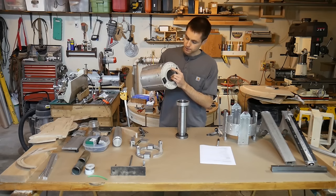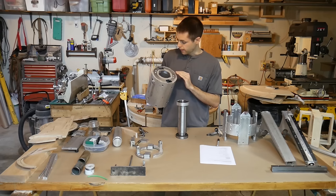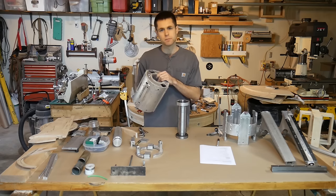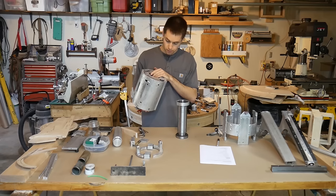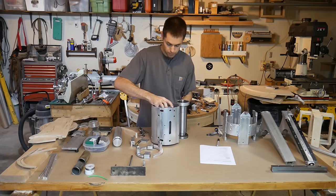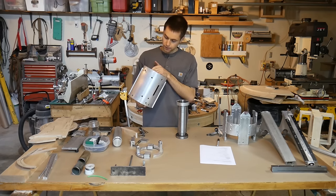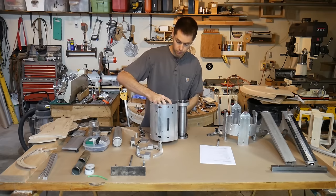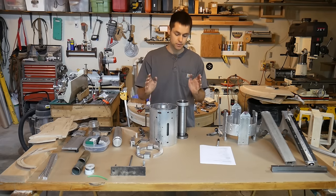The hub is actually epoxied together because at the time I didn't want to deal with aluminum welding or hadn't gotten the equipment and practice yet. I cleaned it very carefully — wire brushed it, did all the things they talk about. This isn't anything exotic, just the Loctite brand of metal epoxy, and it's worked great. I've tested this thing with some pretty decent loads and not had any issues at all. The nice thing about epoxy is that it's a cold process, so it was helpful since I'd already fitted it to the bearing. All of these strategies are going away in the future, but at the time I just needed something to make it work.